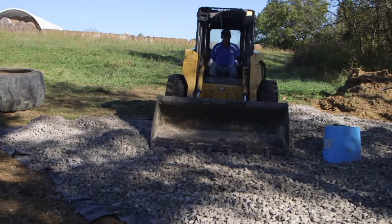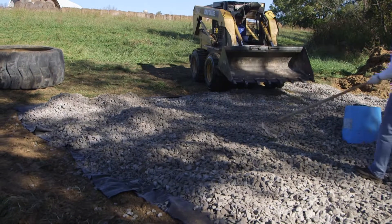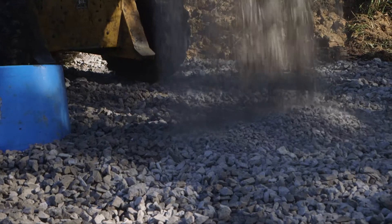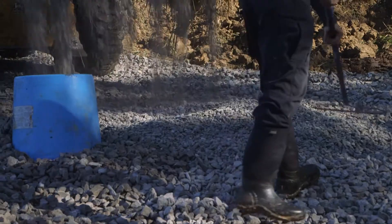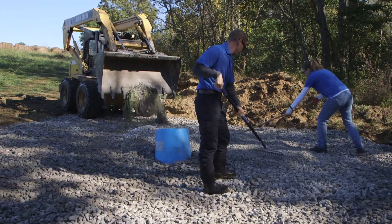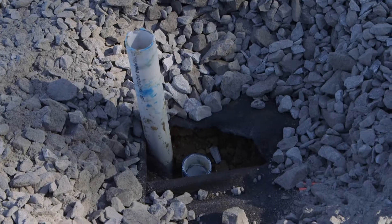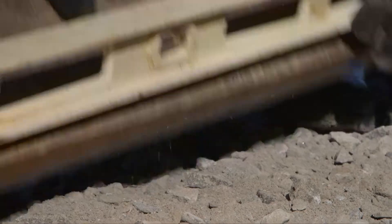You're definitely looking at a day's work to do this. You're going to need something to do some light excavation to prepare your surface prior to installing your heavy use area and concrete pad. You're looking at a minimum of a tractor with a bucket — a bobcat with a bucket on the front really works well for site preparation and moving gravel. You'll also need at least one other person to help with some of the plumbing and to make sure that everything's level when you're setting the tire.